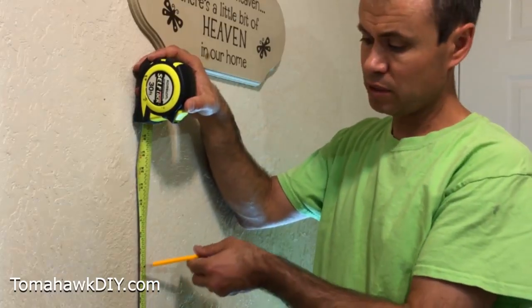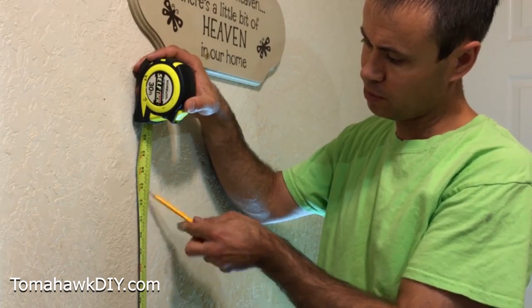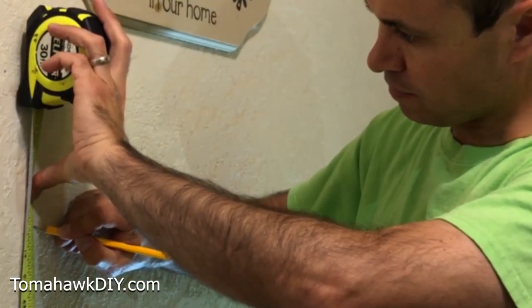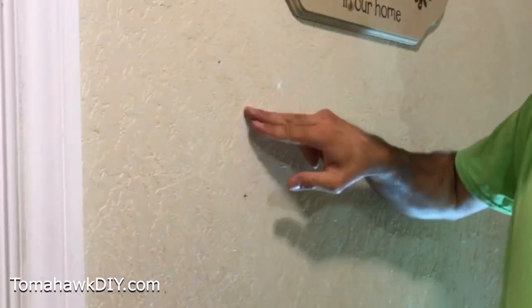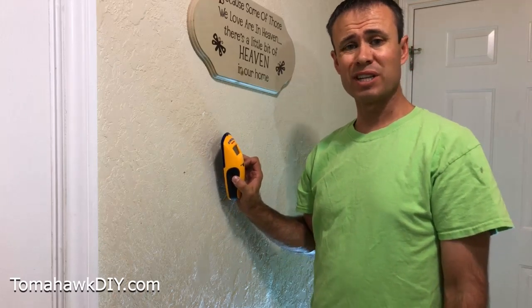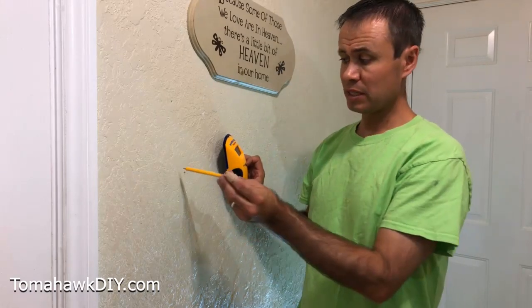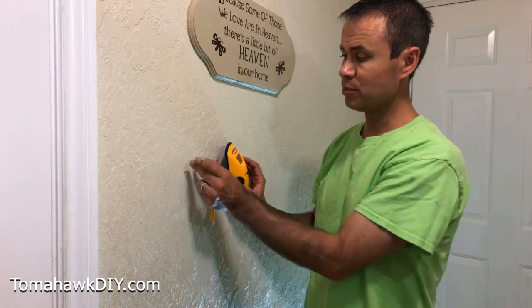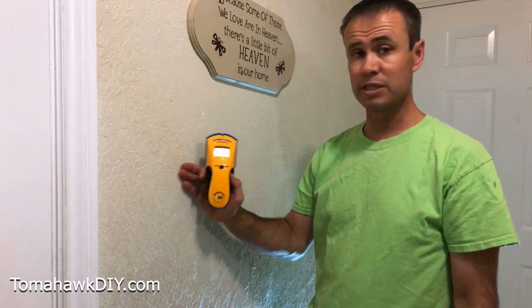Now we've got to determine the height and location where we're mounting these. I want the bottom of my coat hook to be at 48 inches, and the point of the screw is another four inches above that — so 52 inches above the floor. I used a stud finder already to determine where my stud is right here. You want to make sure you're doing that appropriately, and also check for safety items like the power outlet below and the light switch on the other side of this wall — that means there's some wiring running through here. I've got another video that shows how to use a stud finder and some tips and tricks.